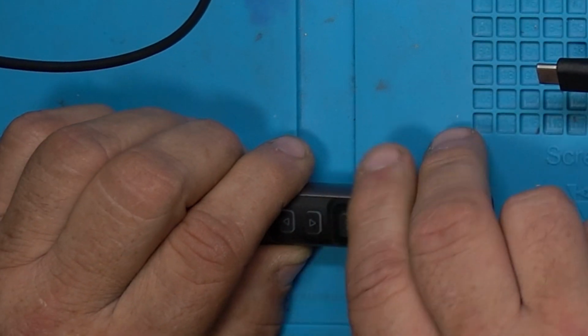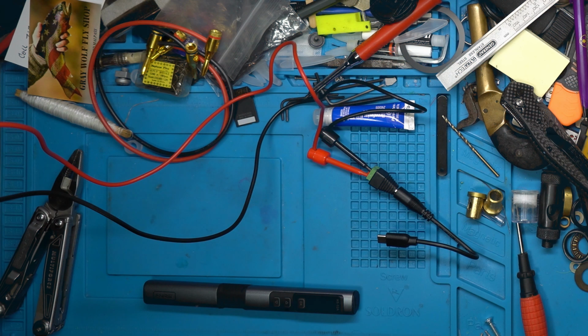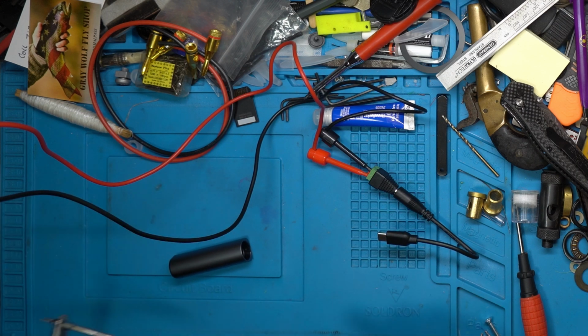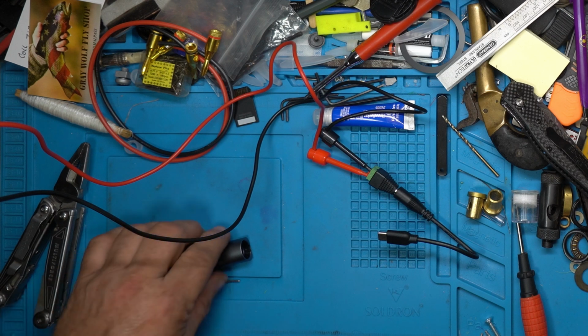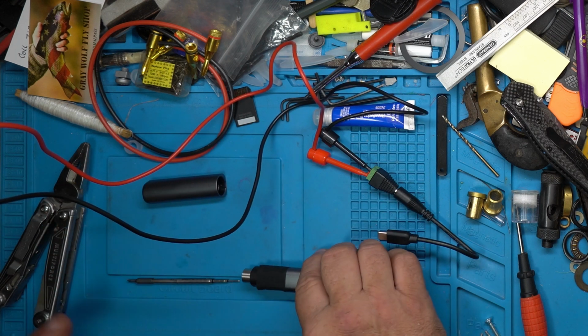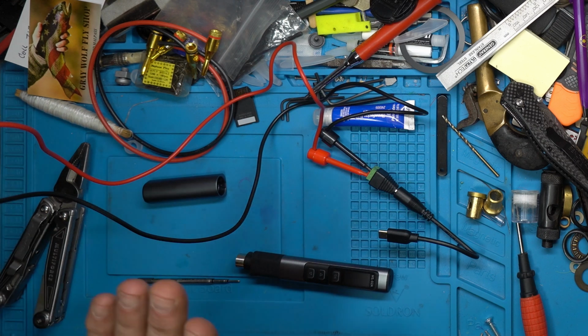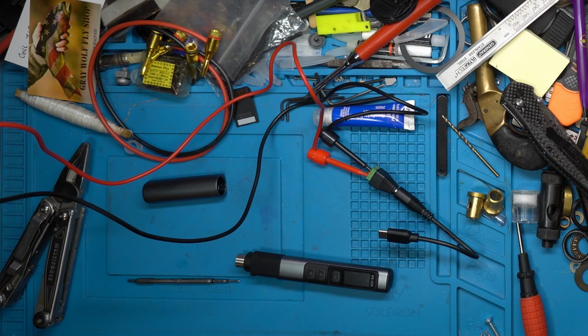So that is interesting. Let me turn that channel off. Let's pull this and let this all cool down again. The reason I've got other tips, I could have several tips up here and change out to cool ones, but I don't want a different resistance on a different tip to change any of these settings. That's why I'm going to do the remainder of my testing on channel 1 set to 20 volts, with overcurrent protection of 3 and no over voltage protection on. The only thing I'm going to do is drop the amperage down.